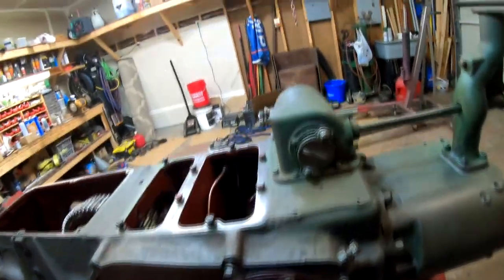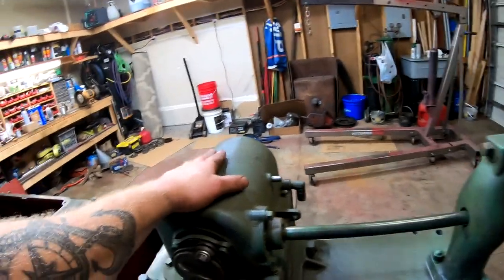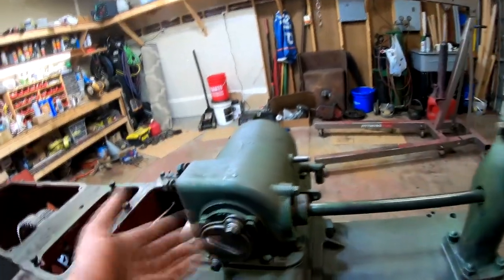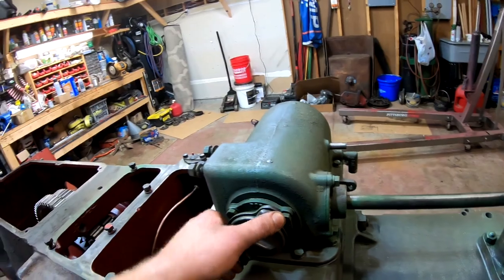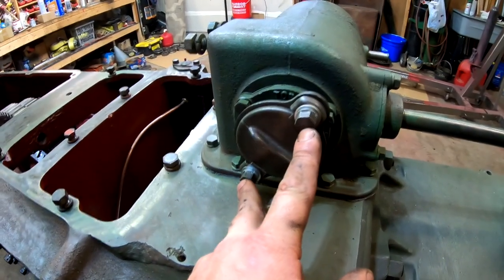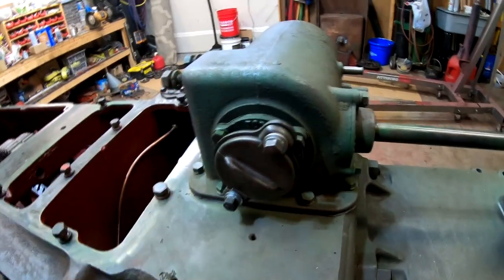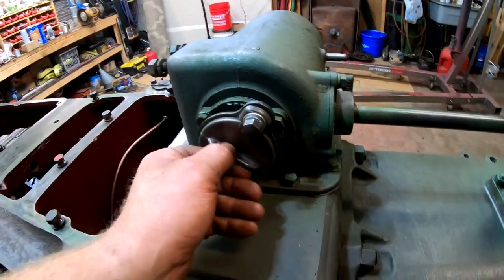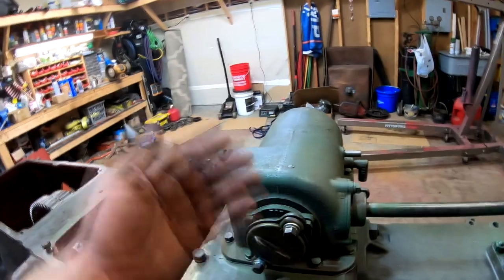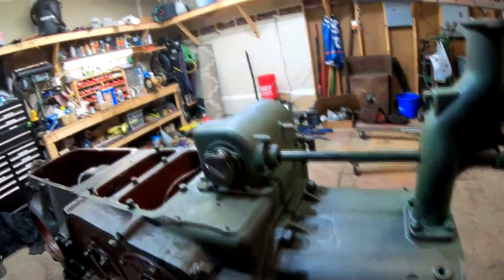So that's good. We did bolt the governor and upper water pipe on. Again, this just bolts to the top, so there's really nothing to be concerned with on that. We made the gasket, but this is not something that has to be timed to the engine, because we can loosen these 2 bolts, and this disc we can adjust in whatever position we need the magneto to be in. So this is how we adjust the timing of the magneto on the tractor. It's not taking the governor off and aligning the gears to punch marks, etc. So we don't have to worry about that. We just bolt it on and go.